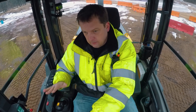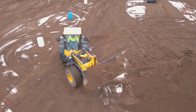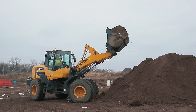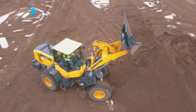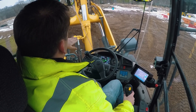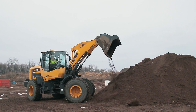For new operators, the key is low and tight to the ground. The biggest risk on a wheel loader is when you're up high and turning — that's your riskiest point. Ideally, you want to be lined up straight before dumping. As you dump, note that the bucket comes down another four feet as it opens. A good strategy: as you go right-hand right to dump, also pull back on the boom at the same time — raising the boom and opening simultaneously — to avoid banging into a dump truck.